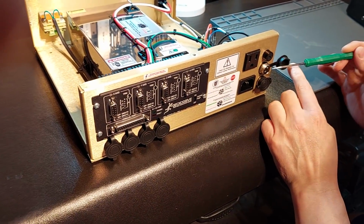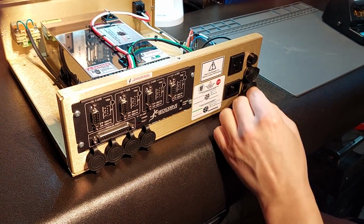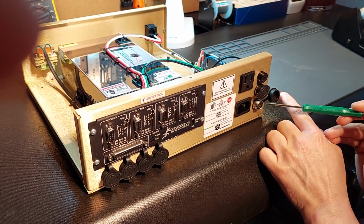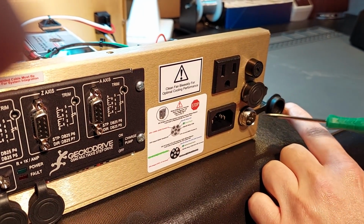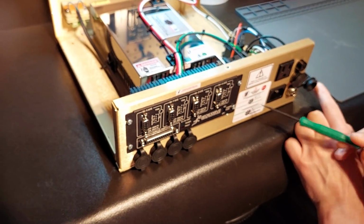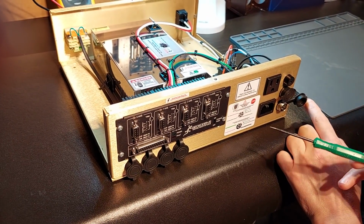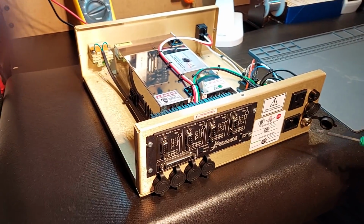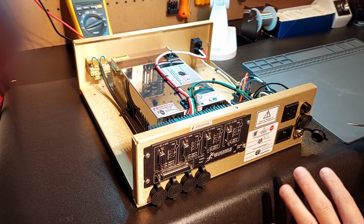On this side, we also have an additional 3-pin, which would be installed to support one of the outputs on the G540. Now, this particular client wanted to have spindle control on his G540 for his business. You see one 6-pin connector being used. Now, why am I using a 6-pin connector? Because while I'm using a GX16 6-pin male connector here, it allows the end user to utilize one cable to supply all of the required connections from the G540, including the shield drain, which must be ground drained inside the enclosure, as far as speed manipulation and also cycling on and off the spindle. That keeps everything much smaller, much neater, and again, consolidates the size of the enclosure having to be used, and also allows maximum expansion inside the box, once again, keeping everything in a much neater format.